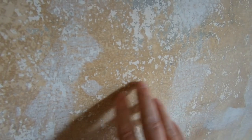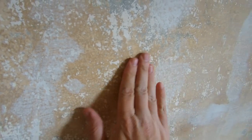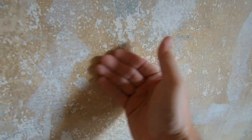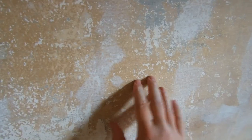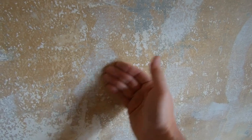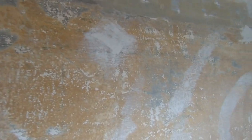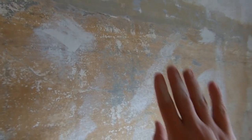When you look at this wall you can see there are all flecks and bits of paint that have come off and been left behind. But if you run your finger over them now that I've sanded everything down, they are actually very smooth. Although you can see all this pattern and think 'blimey, that's not smooth,' run the back of your hand over it — the back is more sensitive than the front — and you can feel everything is nice and smooth. All the filler I've put in and sanded down is nice and smooth now.